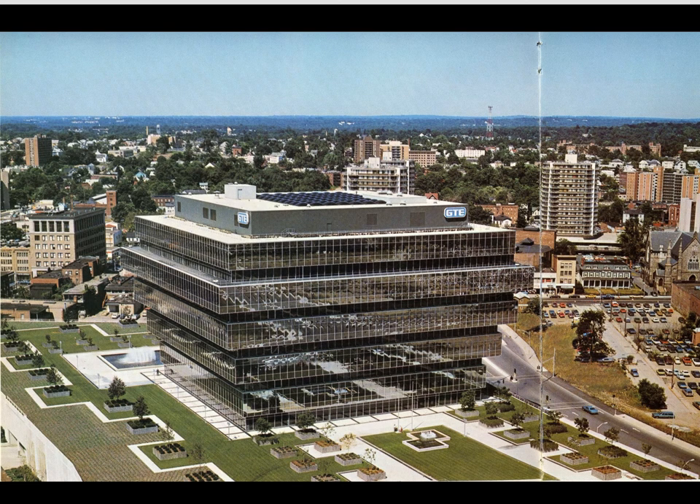Sometimes there are real rewards. This building was designed as a self-shading building — a pretty cool idea that has been done more than once. You have to be careful because elements like elevators and stairs, which get larger as the building goes down, are competing with a footprint that's getting smaller. But things like this can be worked out, and in this case there is a certain solar logic to it that feels comfortable in a really sunny environment that is harsh from a cooling standpoint.